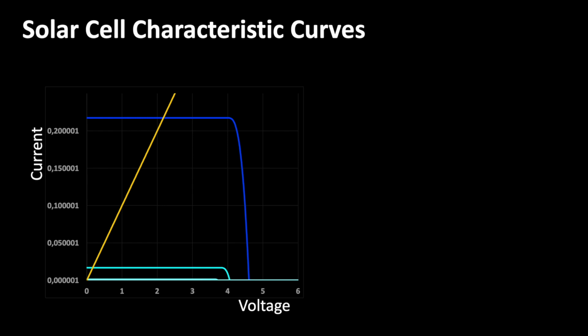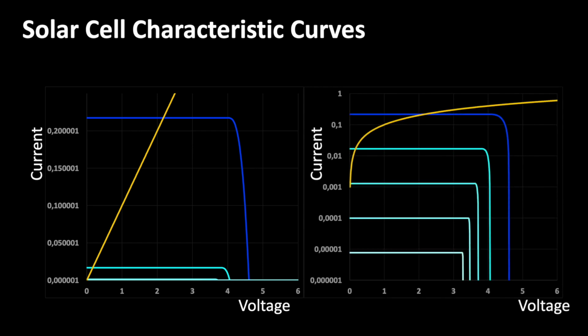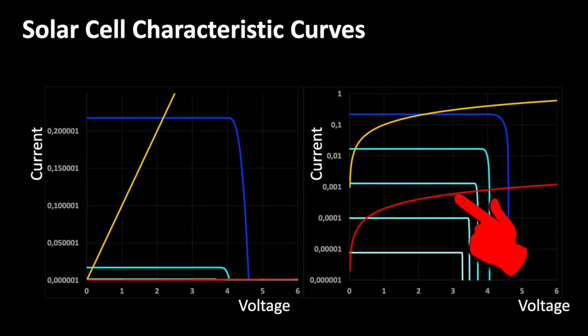If we want to measure small illuminances, then we increase the resistance. In order to understand this, we now have to go back to the logarithmic representation. By the way, a resistance is no longer a straight line in that diagram. We can see very nicely in this chart that we can cover the entire range by increasing the measuring resistor. We always get an almost proportional voltage in relation to the illuminance. This is exactly what we achieve with this strange wiring of the potentiometer.